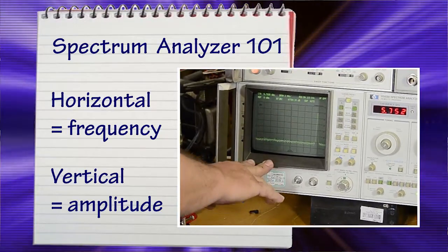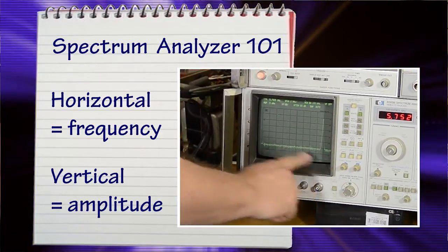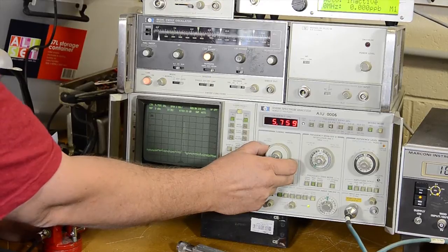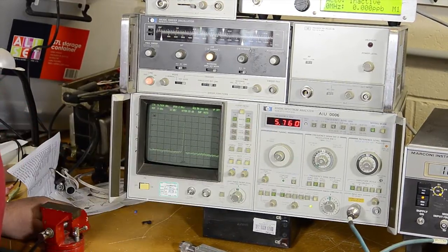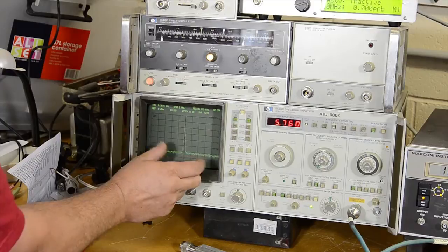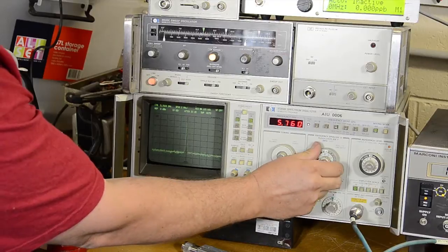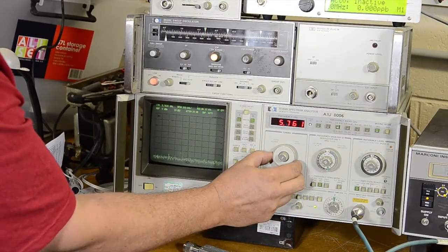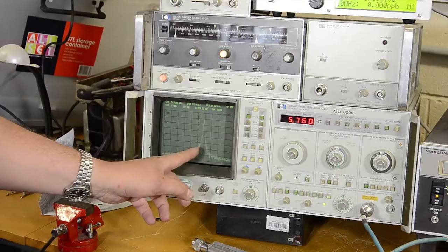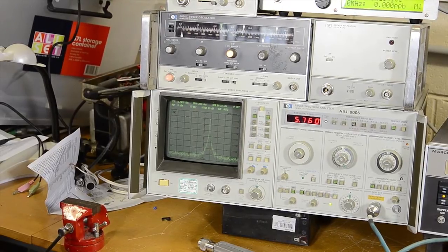Starting from the left, just a bit of spectrum analyzer 101. This is a frequency device, so we're sweeping the frequency from left to right rather than sweeping in time. This is showing a signal on around about 5.76 GHz coming out of the signal generator — it's relatively clean, not too much spurious content. If I widen the bandwidth, you can see just how clean the signal is. The bits of fur around here — if you get that too wide — that's known as phase noise. So you can see that's relatively clean. As a portable field source, it's ideal.